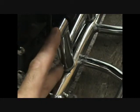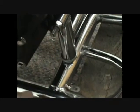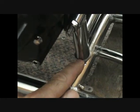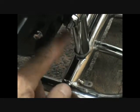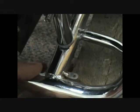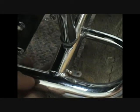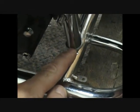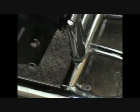One problem we had is down at the bottom — the instructions do explain this — the lower motor mount does not mount correctly and there's a small gap that you have to fill with washers yourself, otherwise it won't rise up enough to get the bolt lined up. We had to go into the bottom side and drill it out a little larger to accommodate the Allen screws that go up inside.